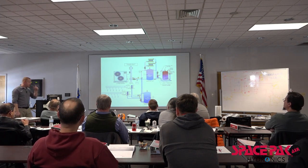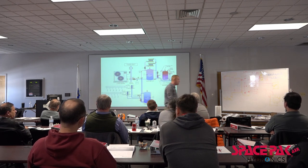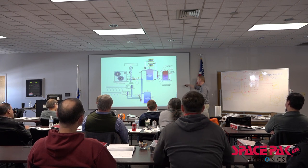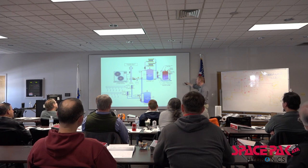Another application you can see here, right? So we talked about domestic hot water and how we recommend it not be the sole source of domestic hot water. Let's say we had an electric water heater, and we then used a plate heat exchanger, right? Maybe all we have to do is deliver 100 degree water to here, because it doesn't take much for an electric water heater to drop down to the 80s. So when it drops down to the 80s, we can start pumping 100 degree here.